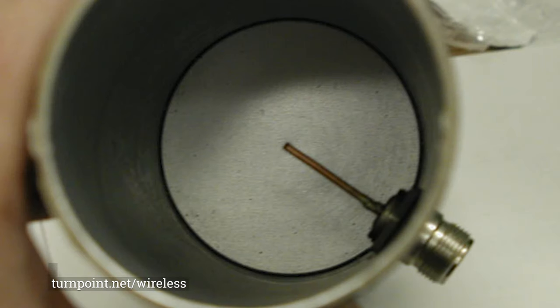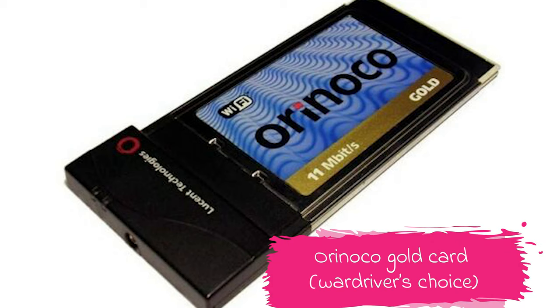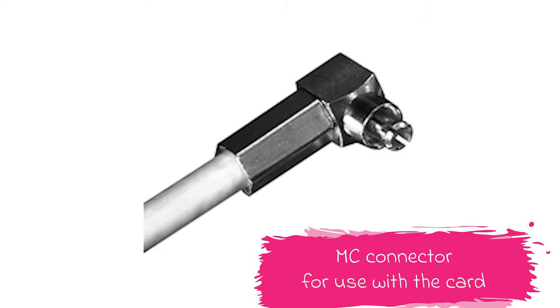How we did it was using a common antenna back in the day: a Pringles can antenna. You basically take a can of chips, eat all the chips, clean out the oil, then take a little piece of wire and put it in the back of the Pringles can. You take a connector at the back and hook it on, then connect that to a wireless dongle or PCMCIA card — a card that plugged into the side of your PC. Eventually that went away in favor of the ExpressCard format, and later USB and other technologies.